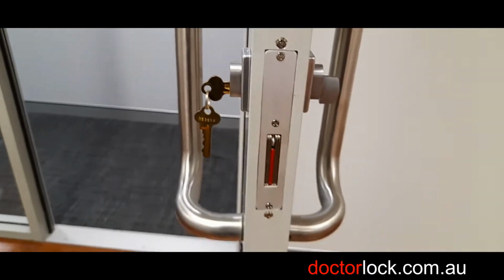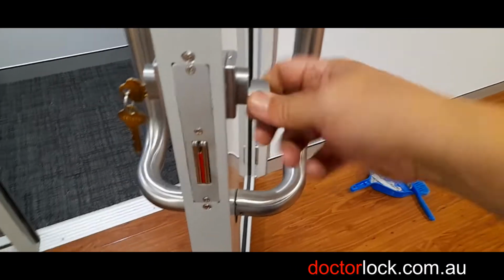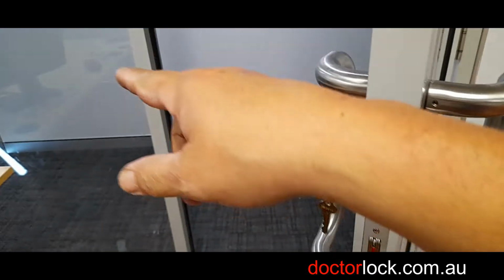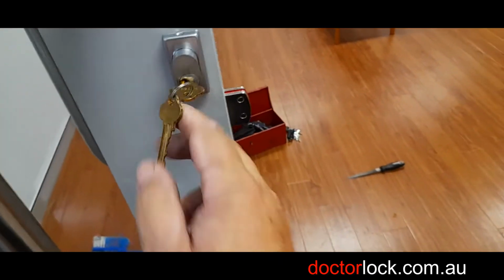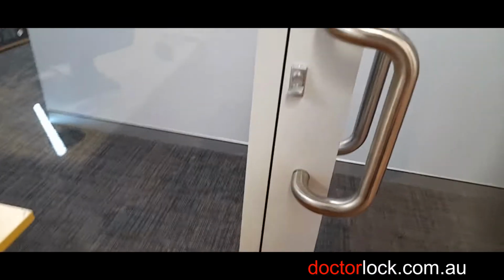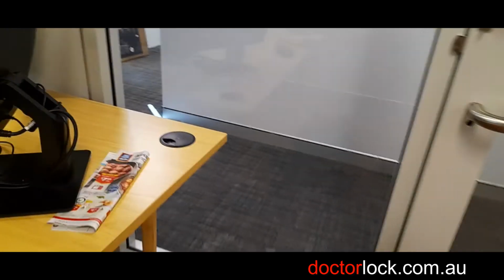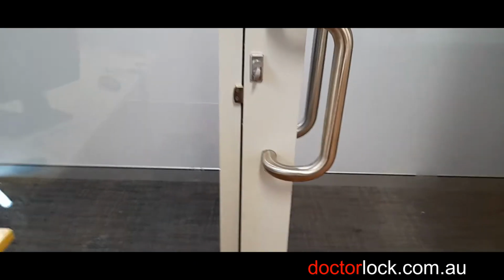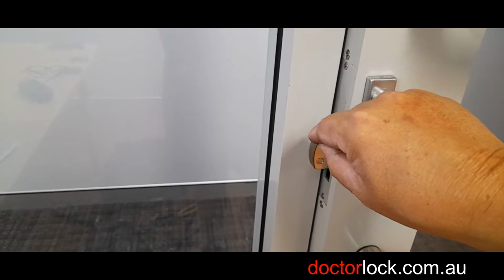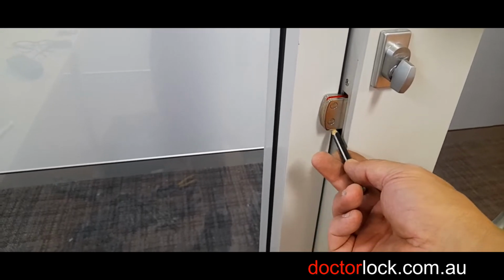Good morning, Locksmiths. Okay, so we've just finished installing this lock here on this door. What we have to do now is cut in the strike for the actual lock. There's no striker plate with aluminium mortise locks, but what we'll do is mark this out top and bottom, and also the swing that the bolt is going to swing. So the first thing is mark top and bottom, pencil. We've got our top and bottom marks.